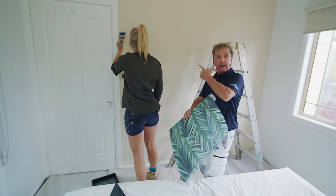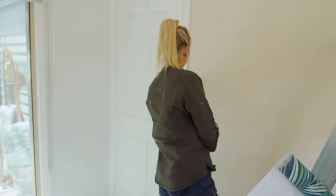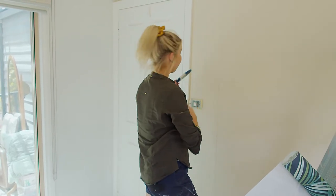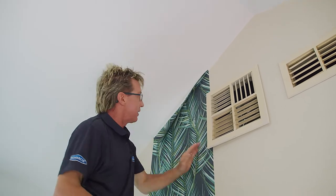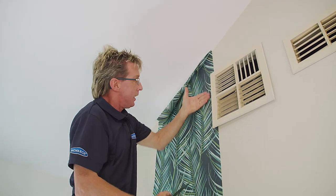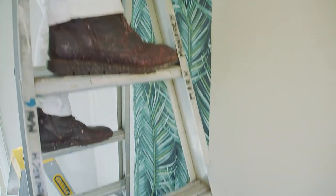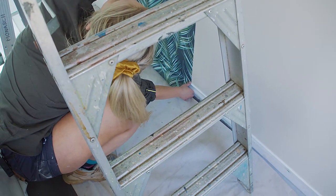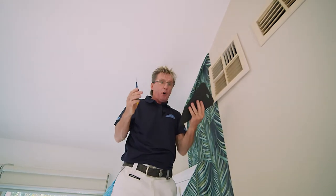You put on enough paste to be about a roll width and then you're ready to paper. Just cutting in with a brush like you would when you paint, then get the roller and go over it afterwards — be really generous with the paste. We've started to hang paper. We've got the pitch roof so we need enough paper up there to get our cut right. I've tucked it in behind the vent, followed our plumb line, with the roll of paper resting on the floor which takes the pressure off. Now we can start smoothing out and trimming the first roll.